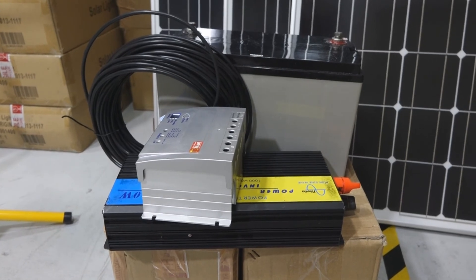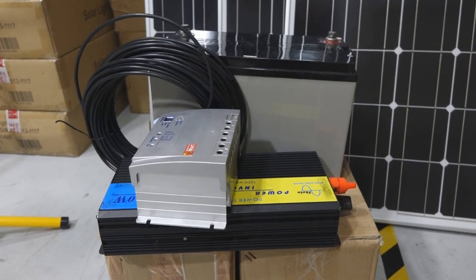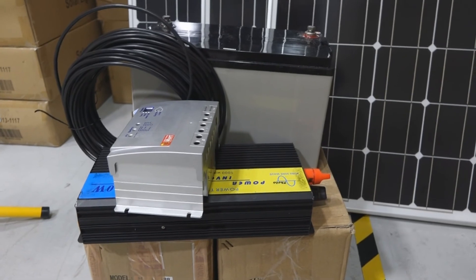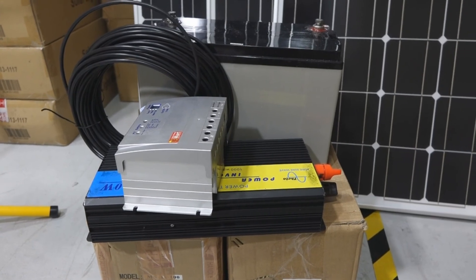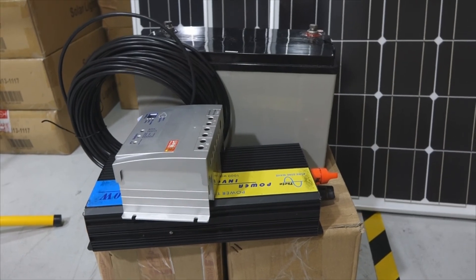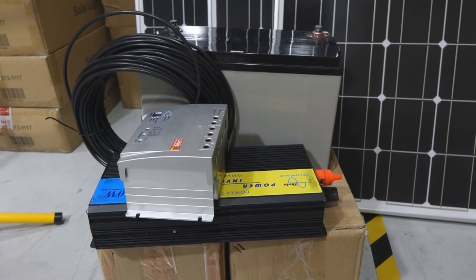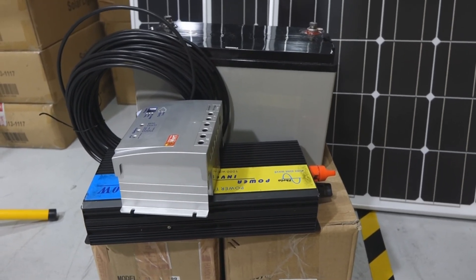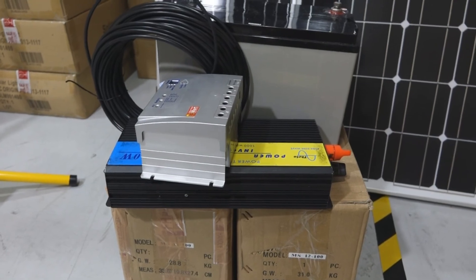But sometimes the floodlights are spread across all four corners, and when you run cable that long in DC, it's not advisable because the voltage drop is going to be huge. Sometimes the idea is to use a very big size low voltage cable, but sometimes you can't find such a large size. So at the end of the day, you probably have to use an inverter to do everything in AC.